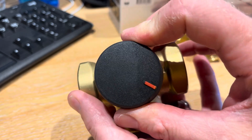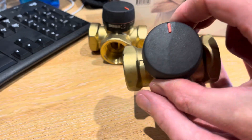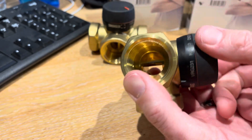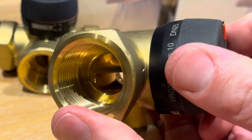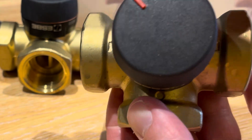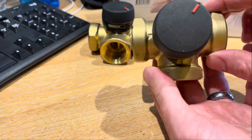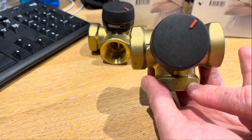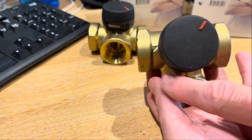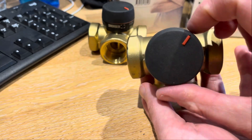I can't do much more on that at the moment without the actuator, but I'll do a second video with the actuator. The big difference between the 130 and the 230 series is that the 230 series has a T-shaped shoe, whereas the 130 series has an L-shaped shoe. With a 90 degree rotation it will close off one port, and if you go across 90 degrees it will close off the other port. On the 230, the only possible way you can configure it is input, output, output — you can't do it any other way, irrespective of what you do.